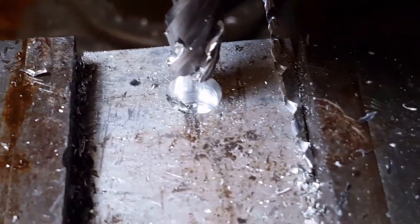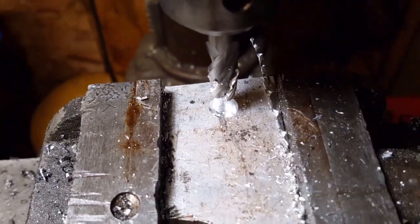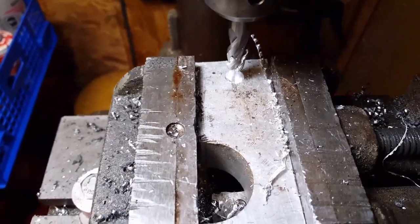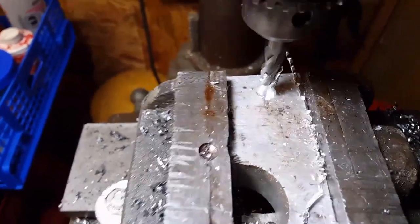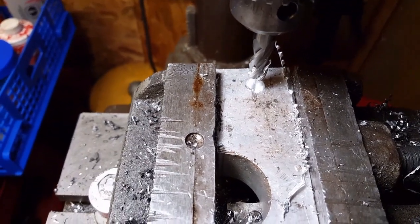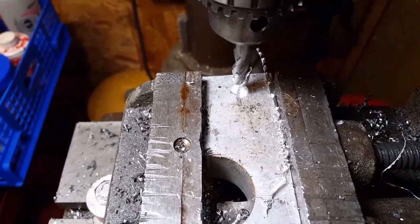Not too shabby — that's not too bad at all. The issue is probably going to be milling. Now if you're trying this on steel pipe with a 2-flute end mill, I'm sorry to say, but this is a 4-flute carbide end mill, which may make a little bit of a difference. The next cut we'll do, we'll try to actually mill a little bit — I'm going to try to cut about a little less than a sixteenth. So we'll see how that goes.